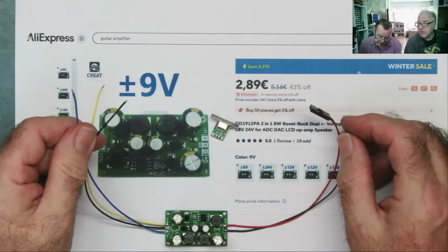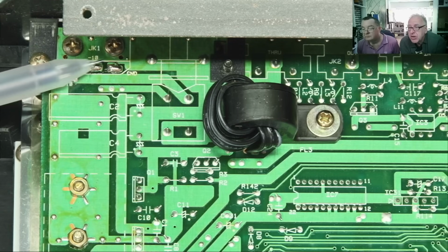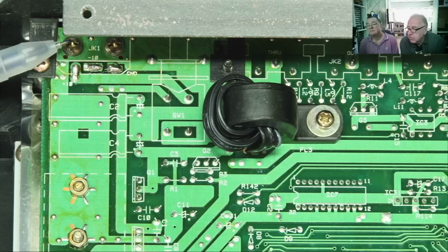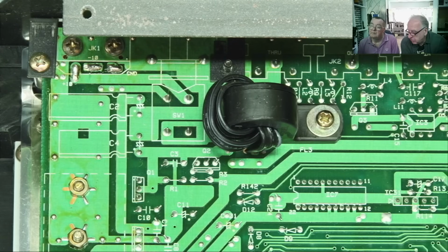Are we gonna solder this onto the PCB? So this is actually the PCB of the drum machine. We just removed the back cover, so we don't need to remove anything else because it's already here, and you can already tell minus 10, and there's a plus 10, and there's a ground tab. So this is the backside of the little weird connector, and we simply slap on the 3 wires on here.